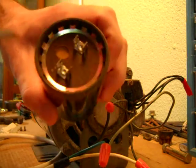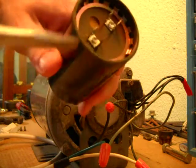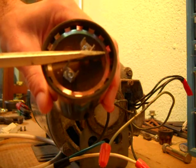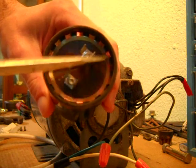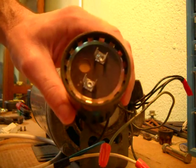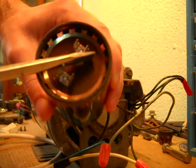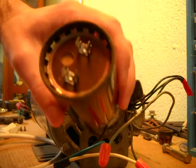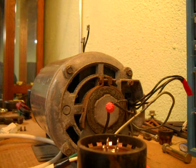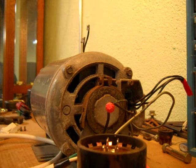What you're going to want to do is take a screwdriver and short these two terminals out. This capacitor here is now discharged. It should discharge the first time that you do that. That's pretty much how you do it — just short out those two terminals and you'll be good. Thanks for watching.